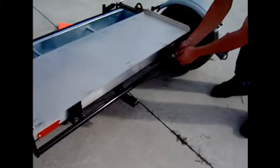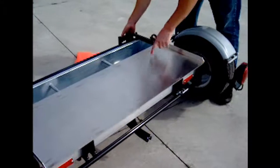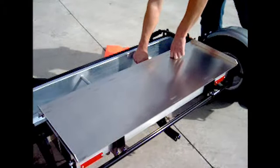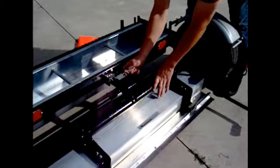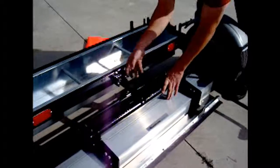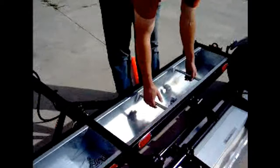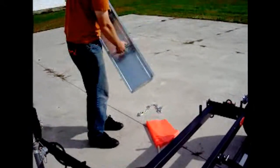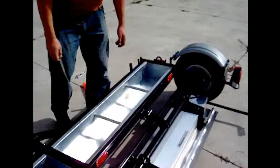Once you get all your debris off, you lower your bar and make sure you reinstall your pin. Flip your magnet back into towing position — when the sweeper is in towing position it pinches the bin down so it can't come flying out when you're going down the road. Always reinstall the clip. To empty your debris bins, you simply walk around to the front, lift them out, pour your debris into your debris holder, reinstall your pan, and you're ready to continue picking up metal debris.